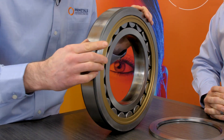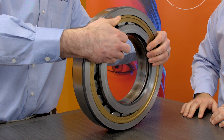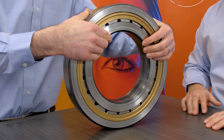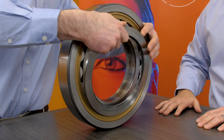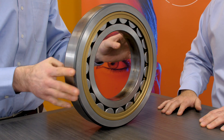What's interesting about this roller bearing is that cylindrical bearings handle only a radial load. They can't do a thrust load, which is in this direction. They come in different cage configurations — this one happens to be brass and phenolic. They also come in certain plastics and are used in a variety of applications.